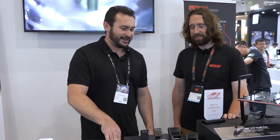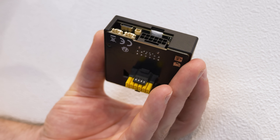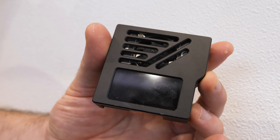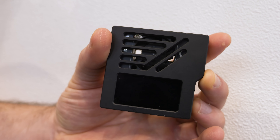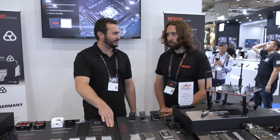We'll move along to what's probably my favorite Thermal Grizzly product. I did love the Wireview and I've talked with Roman a lot about it and made a few suggestions. Since the Wireview was first introduced, the high power connector seems to have only gotten worse. With the way it works and how Nvidia has implemented it, any safeguards that it did have, they seem to keep removing. So the Wireview 2 will help with that — there's sensing for each one of the six 12-volt connections.